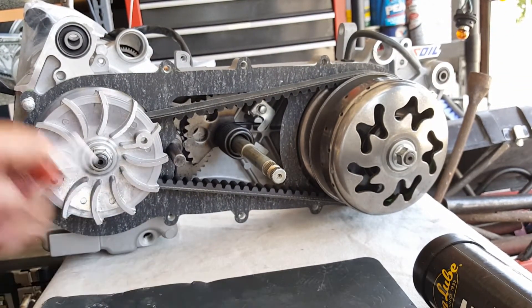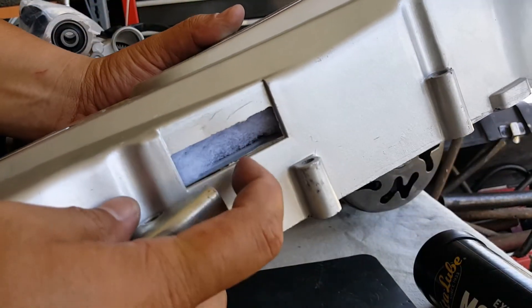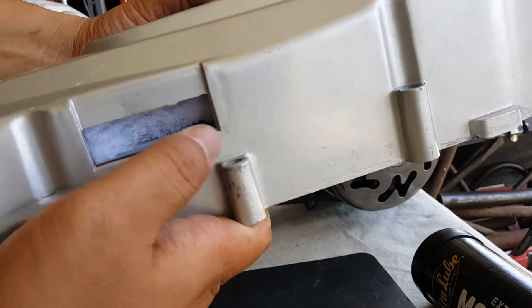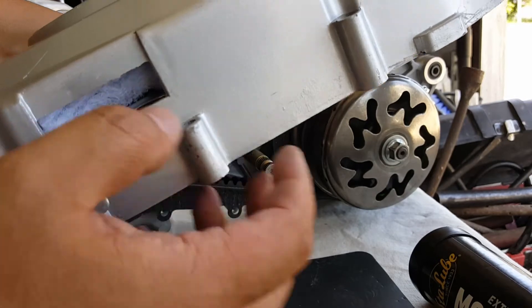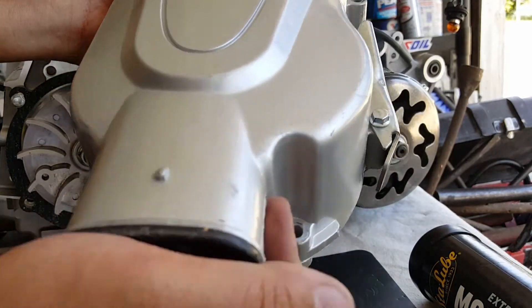We're going to put one more coat of moly grease on this side of the case and then it's ready to be closed up. There's a plate here and we also put a special mesh filter material so it doesn't burn, because this gets pretty hot. You don't want to use any arts-and-crafts cushion filter — go to the auto parts store and get a lawn mower filter you can cut to size. We put some in here as well to keep debris out while still allowing airflow.